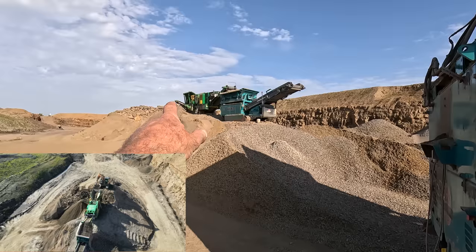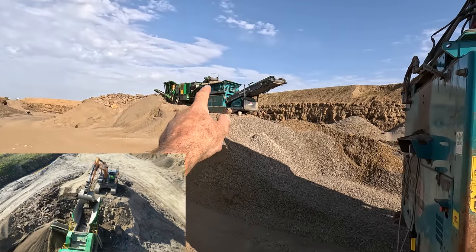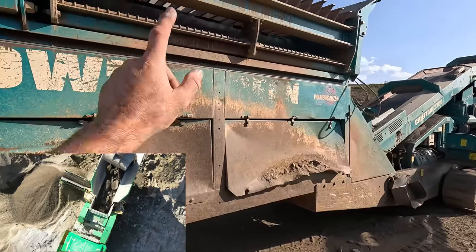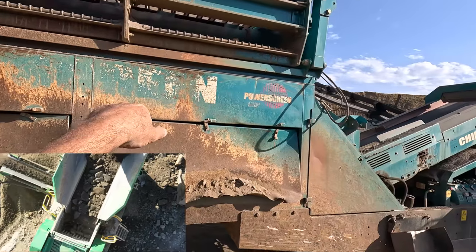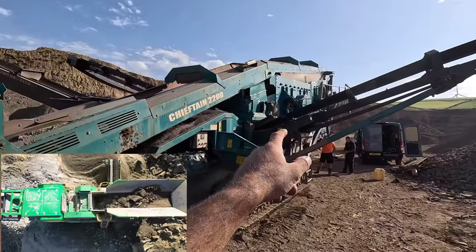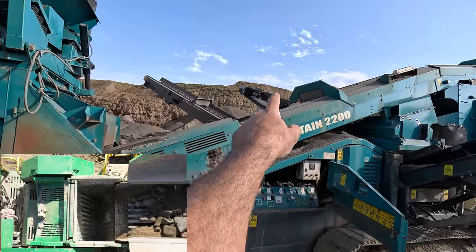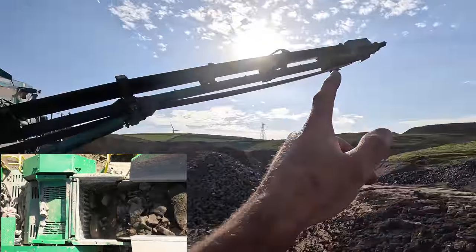There's a J45 crusher at the back there, feeding the little 750. That is another live head. And off that conveyor comes into this live head. We'll get the 3-inch material coming off here, so we'll have 45mm meshes in this live head. Everything that drops through the 45 goes up the conveyor into two screen boxes. Out of the front conveyor we get the fines. We'll have 10mm coming off that conveyor, 40mm coming off that conveyor, 20mm coming off that conveyor.